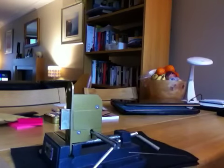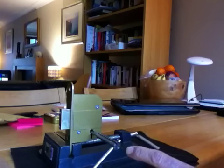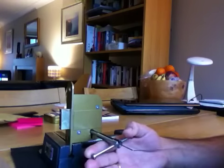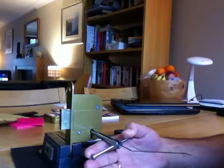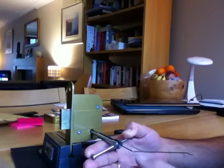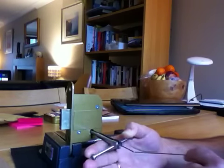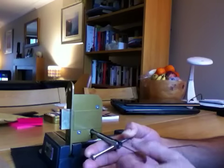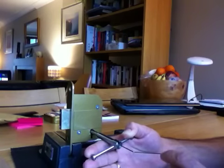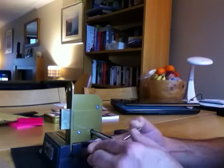Something else I learnt off the forum — particularly from one member I've PM'd quite a lot regarding high-low levers. I think you know who I'm talking about: Pete. Now this old wire here — make sure you understand: that's locked. The weight is sitting at about quarter past three. Lever five — quarter past three. Lever four — same. Lever three — see, that hasn't moved, quarter past three. Now skip to lever one — look at that, three o'clock. What does that tell you? That tells you if the others are high, lever one is a low lift. See how it's dropped down? This one is low, so the others must be high lifts.